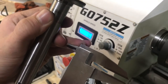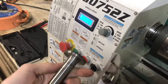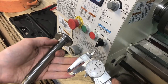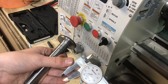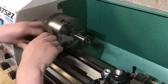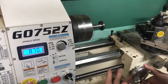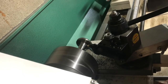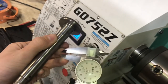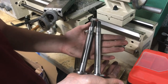Using the step function of the calipers — which measures from one face to another — I'll slide that right on the face and push it up to the next face. That reads about 140 thousandths. If I took off a little more material that would be better, so I'll chuck this up and face about 10-15 thousandths off. A nice cutting RPM with a manual lathe and carbide insert is 800 RPM; high-speed steel would be slower. Checking the step dimension: that's 130 thousandths — five thousandths difference, within tolerance. Now we've got two nice clean shafts ready for reinstall.